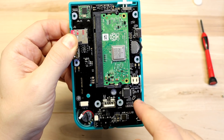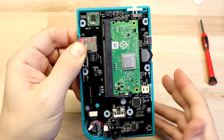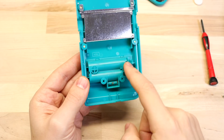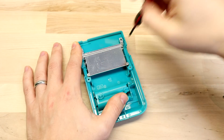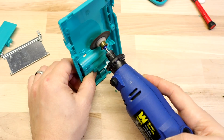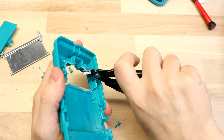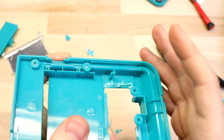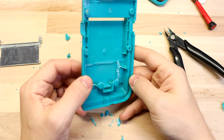You'll notice that I only put screws in a few spots because all the other screw holes are going to be attached to the back side of the shell. For the back of the shell, first we're going to remove the bulk of the battery compartment — just make sure you keep both of the screw holes. You can remove the metal shielding; we're not going to need it. If you have a Dremel that'll make this part a lot faster, then you can clean up the rest with flush cutters. Make sure you keep the post as well because that'll help support the PCB resting on it.